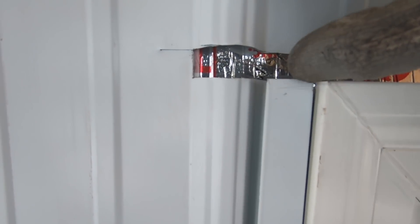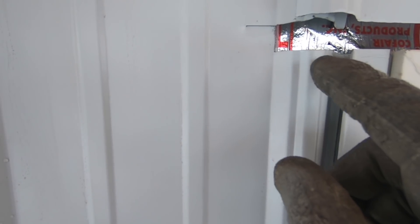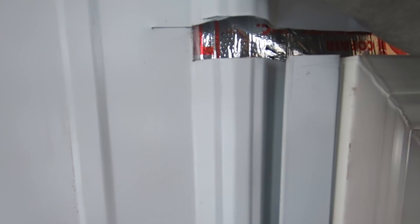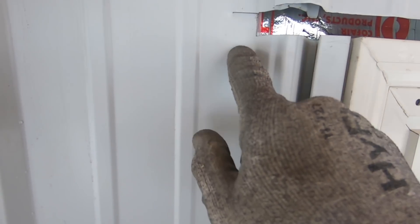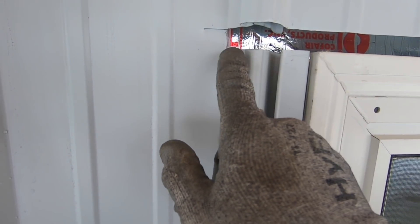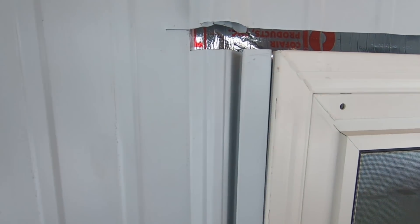You can see I cut that out right flush with the edge of this rib, and then I actually filed that off because you want that nice and flat. Then I notched it one inch past, so the trim's going to be extended a little further than usual, but honestly nobody ever notices that stuff. And it's the best way to make sure this is waterproof. So now I'm just going to put this piece of J-trim in, and then it'll tuck up under there and drop down and sit right on top of that. Then you can just put a little clear silicone underneath where that seam is and it'll be good to go.